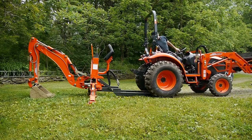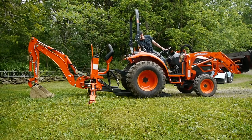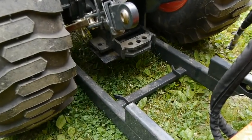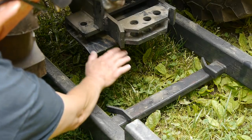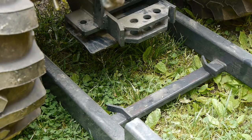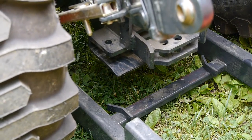The hydrostatic drive is real nice for this — you can ease the tractor back nice and slow. Keep an eye on where you are in relation to the subframe. There is that crossbar right there that slides up into the bracket. Before I raise it up, I like to back the tractor up into position until it's just about right.